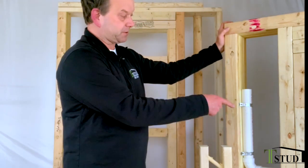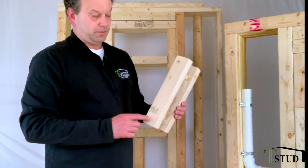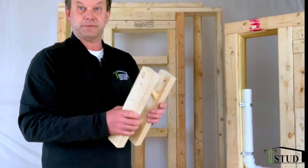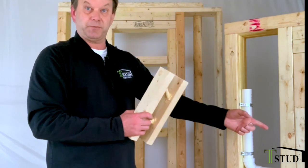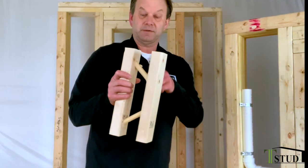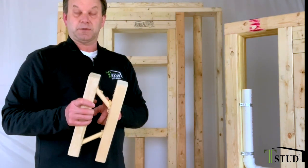For the plumber — the plumber is the tough one. In this case, I have a kitchen window is what I'm trying to replicate right here, and that plumber needs to run a vent horizontal through the studs. When you're framing, one side of the stud you're not going to see the dowels at all, and the other side you will. For the whole entire house, we don't care which way they go — left or right, turn them however you want. But if you know there's a vent going in by the kitchen window, or hot tub, or in the laundry room, you want to line up all your dowels going across so that the plumber can go all the way across without drilling through one of our dowels. You only get one broken dowel per stud in an entire structure, so don't do that.